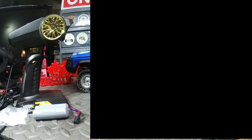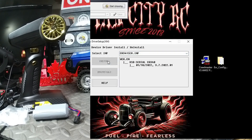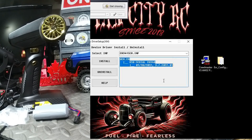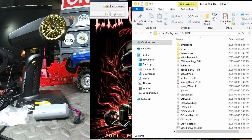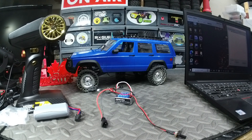I'm going to open up the programmer driver and install it — it'll take a few seconds. Once that's done, we can get out of there and go into the ESC configuration tools. Now scroll down to the bottom where you'll see 'serial port connector' and open that up.